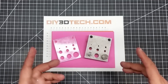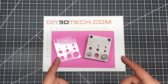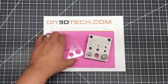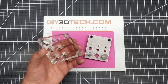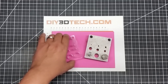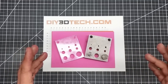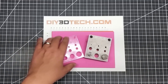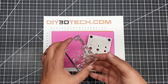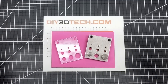You can also export the Fusion 360 sketch to a DXF file and laser cut yourself a new one. Now, you might be saying this is almost a 10 to 12 millimeter thick piece of plastic and you don't have a laser cutter that can cut that thick. Here's what you can do: just get some thinner acrylic, cut a couple of them, and glue them up together. Put the pins through so they're indexed while the glue is setting up.